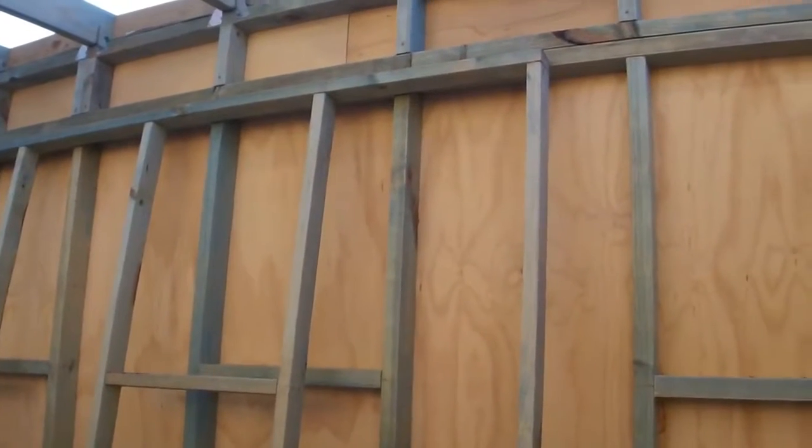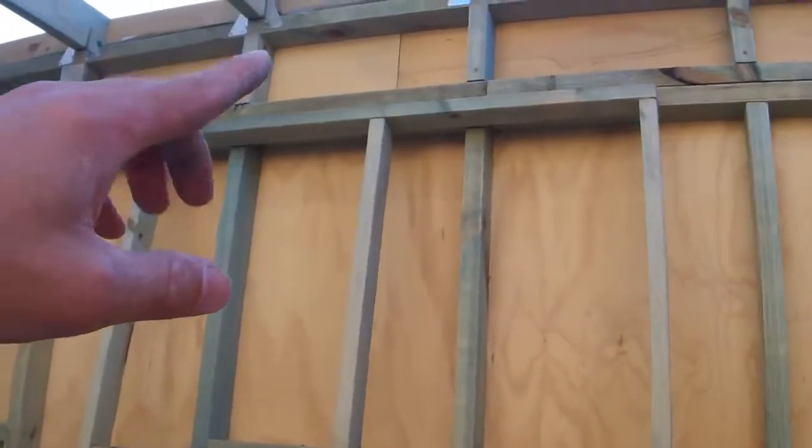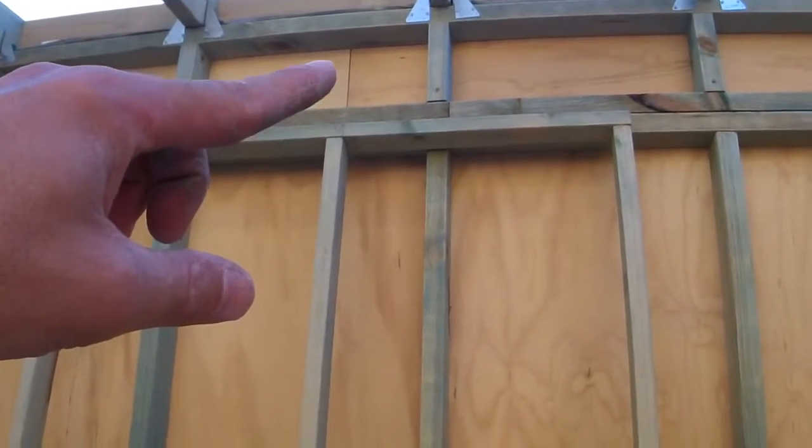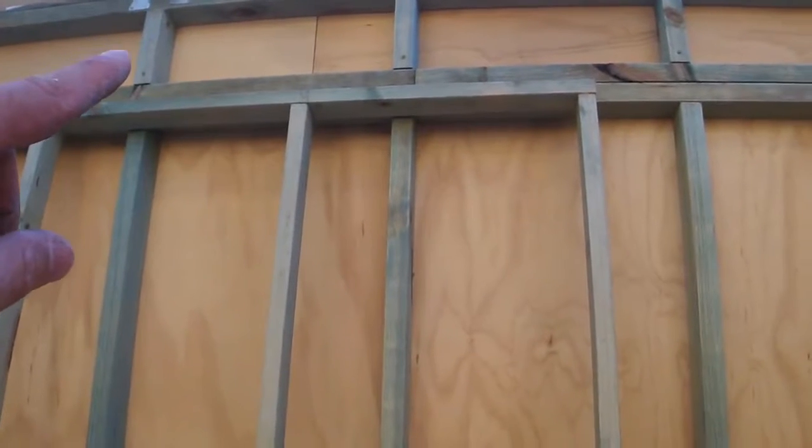You don't want the air from there escaping and going out from tiny holes, so I'll be going around later and sealing the joints as well — making sure that the joints between the panels are also sealed. There are only a few where the joint is visible, so they'll be sealed too. At the moment I'm at a stage where I'm about to finish off the battens on the roof beams, and once they are done the 12 millimeter plywood panels will sit on top, then be covered by weatherproof material, and then the roofing sheets — metal colorbond corrugated material — will go on top.